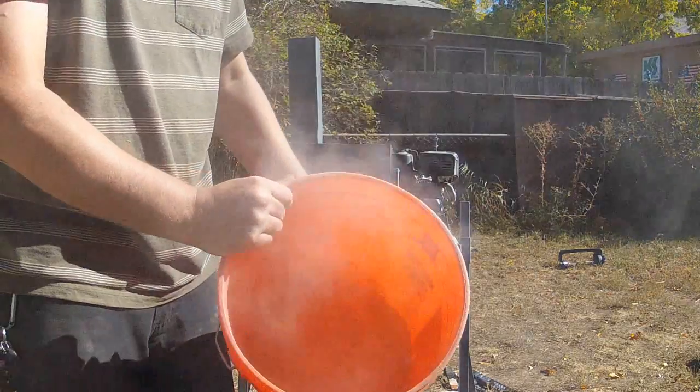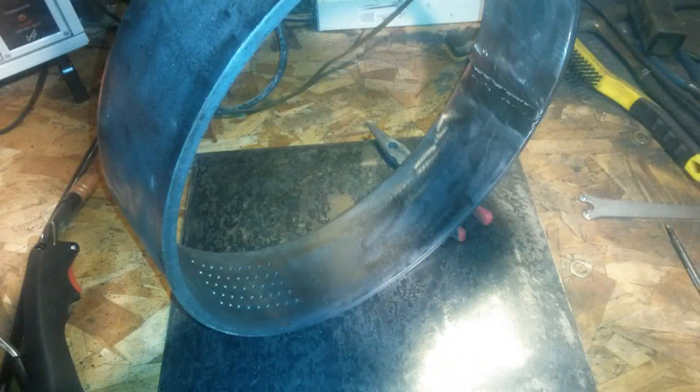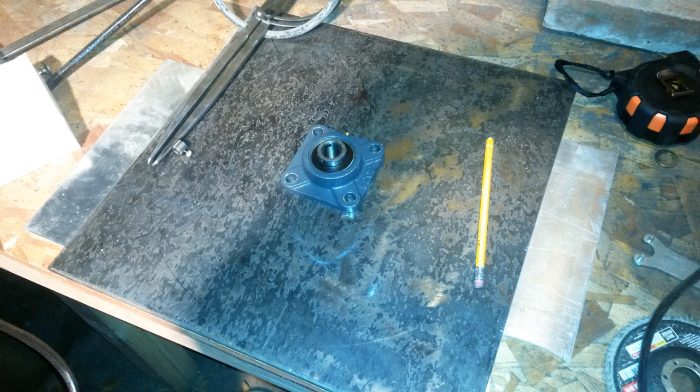I started with 5/16ths by 4-inch flat bar, and I had the local sheet metal shop roll it into a hoop, but next time I think I can just cut out eight pieces and weld them together into an octagon. Another thing is that next time I would definitely use some sort of hardened metal, because this mild steel is already taking a hit. The front and back plates are quarter-inch steel, which seems sufficient, but if it was a professional design, I would definitely be using some kind of hardened steel here.